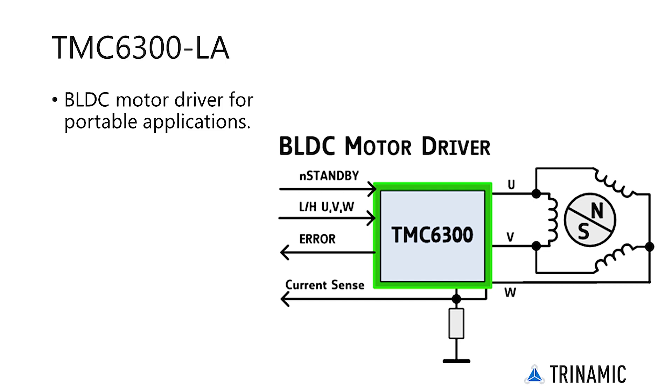Put the IC into low power standby by switching all input signals to ground. The optional diagnostics output signals over temperature or shorted bridge condition and becomes cleared by going to standby for a short time.